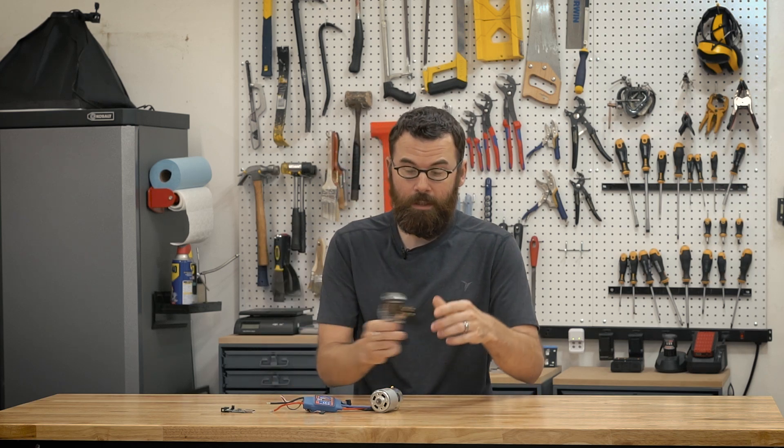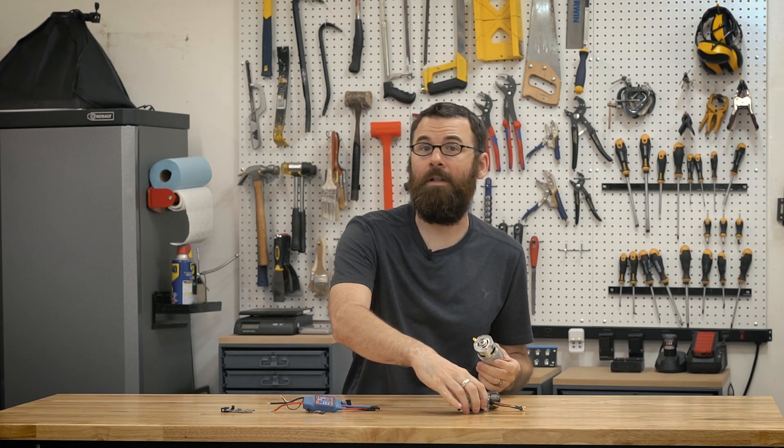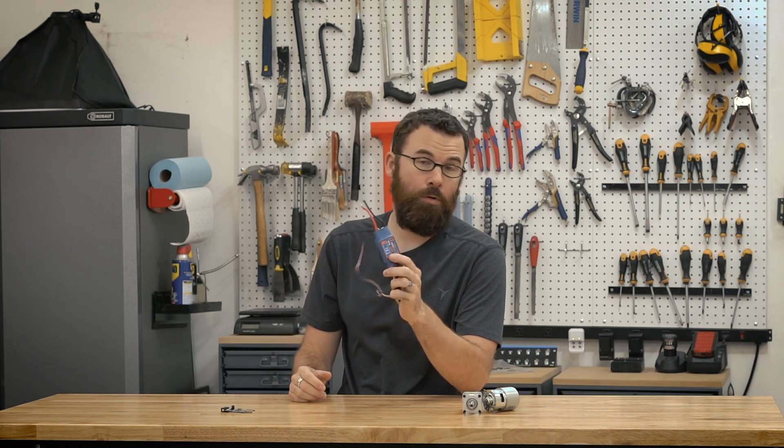So what's so special about brushless motors? Generally speaking, a brushless motor has a much higher power-to-weight ratio than a brushed motor. For instance, these two motors are roughly the same amount of power, and as you can see, the brushed version is significantly larger and heavier. However, with a brushless motor you need a specialized motor controller called an ESC — the electronic speed controller. Most inexpensive ESCs are throttle-only, meaning they only go in one direction — either forward or reverse — depending on how you have it configured. So by loading a different firmware onto the ESC, we can actually make it do drive, meaning forward and reverse like a traditional brushed motor, and we get the extra added benefit of the power-to-weight ratio of the brushless motor.